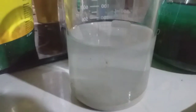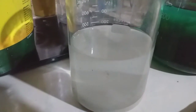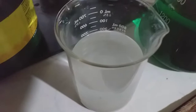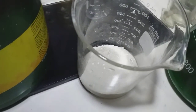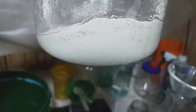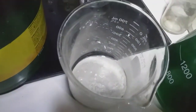About cleaning the silver in this process, you don't need special skills. It's only to add hot tap water 3 times until there's no green color in there. So this is the 3rd time, and now I pour into this filter to capture some floating silver in there. And after this, we melt this one. After 5 times adding hot tap water and multiple rinses, this is our silver. And we dry this with my hot air, and then we melt.